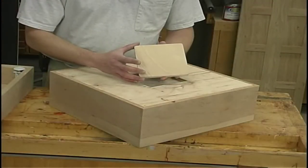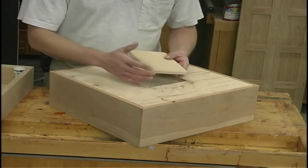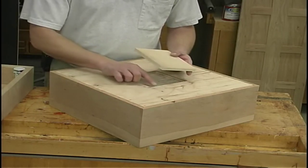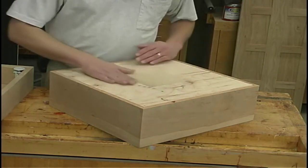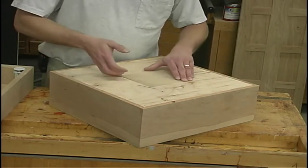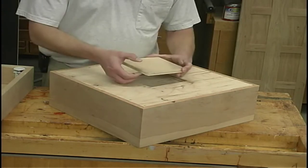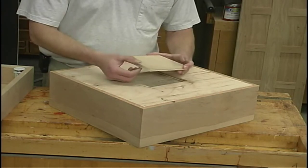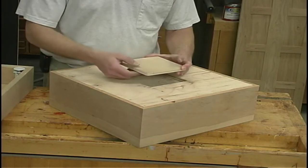To make the key, take some half-inch birch plywood, rip it and cut it to length, and round over the corners to match the corner radius of your router bit. It should fit in there nice and flush, allowing the top to fit up tight against the ceiling. This key needs to be attached to the ceiling — be sure to use screws long enough to penetrate not only through the plywood but through the drywall and into the joist on the ceiling.